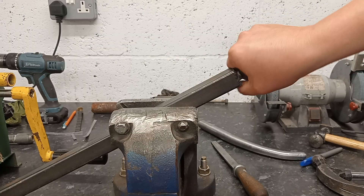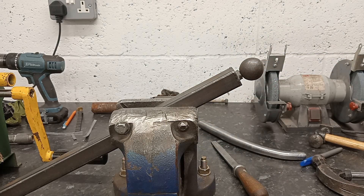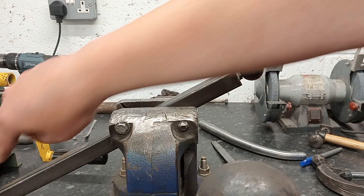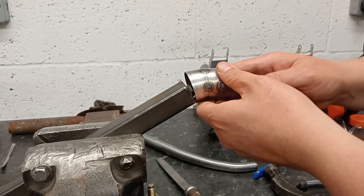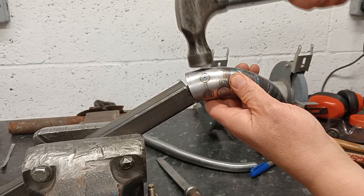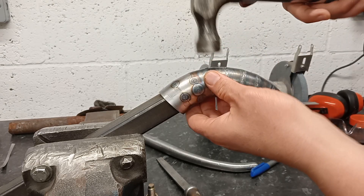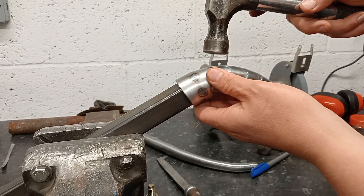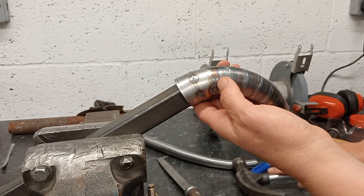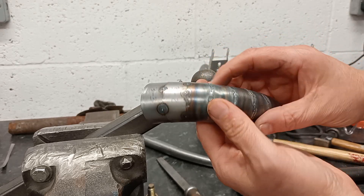These are bits I got from an iron gate website where you get all the bits to make your own iron gates. It's just drilled and tapped, goes on there. Different sizes — not central but it doesn't matter. Should maybe polish it a bit, but the next size up goes all the way up to really big ones, and that goes on down there on a slightly bigger thread. The idea is to use this to planish the weld — you're trying to planish and stress-relieve the weld, get it nice and smooth and take any rough bits out.